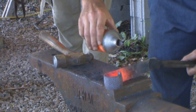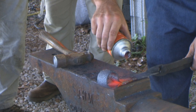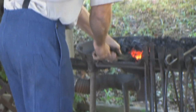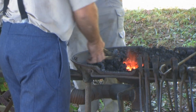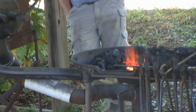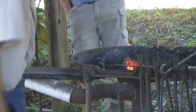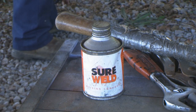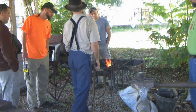After you do a forge weld, you want to always flux — repeat flux — as long as you don't have it completely finished, in case there is a little cavity in there. Just a little bit of borax, that makes the flux nice, but it will burn too, so I'll get it flowing.